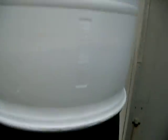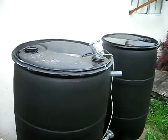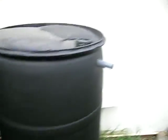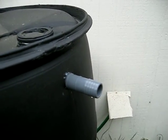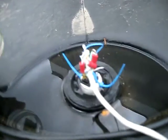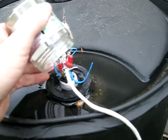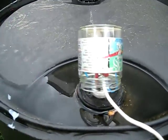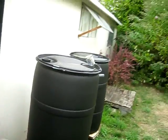The sand filter goes down through two pipes to the very bottom, fills up, and fills the three barrels. They're all three connected together and they all three have drain spouts at the top so they can't overflow. Here we have the float switch that we detailed the construction of earlier. It controls how long we can pull water out of these — we don't want to be running the pumps dry for too long.